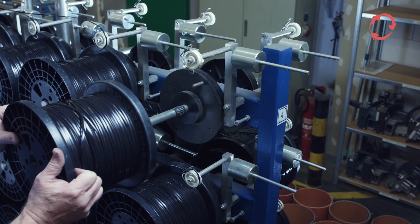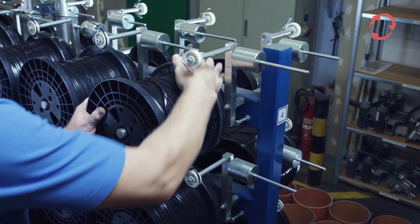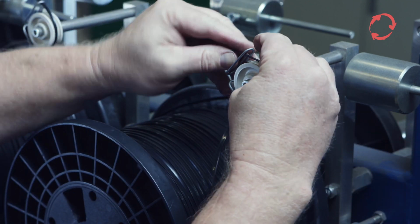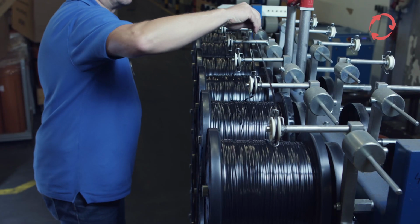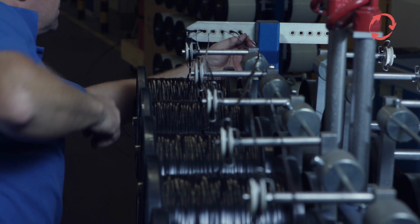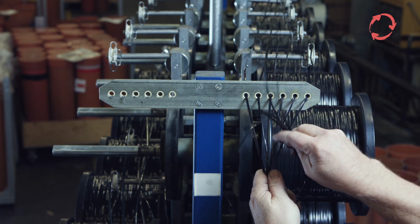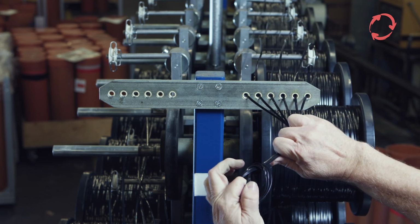The wire coils are placed on the intakes of the creel, so the driving pin grips between the ridges and the coil after overcoming the resistance of the barrel springs. The wires are now guided around the deflection roller onto the brake lever and further to the guide eyelets. The wire from the rearmost coil is guided through the first eyelet from the inside, i.e. the wires are pulled in from the back inside to the front outside. Tie the wires in the same level together until the machine entrance, so they cannot fall out of the guides.